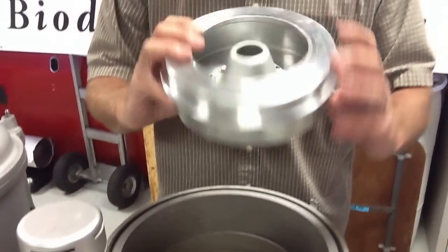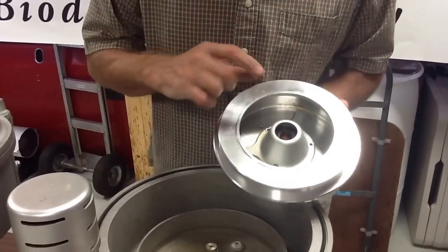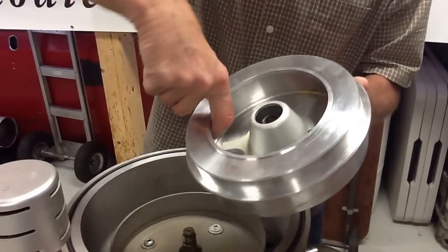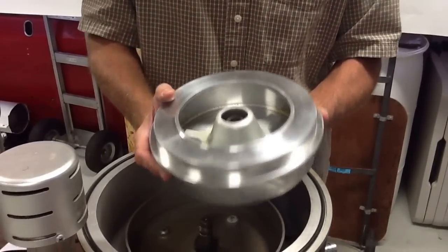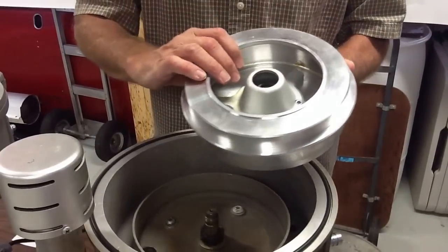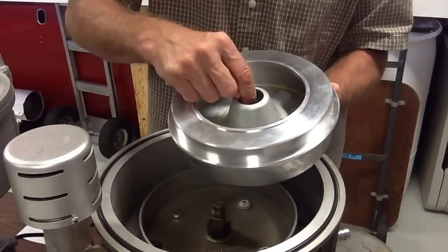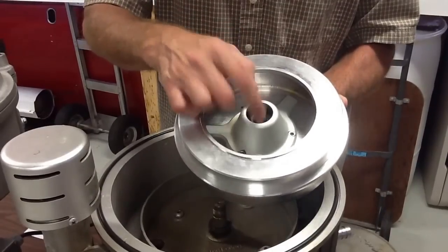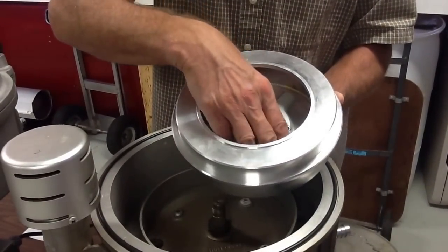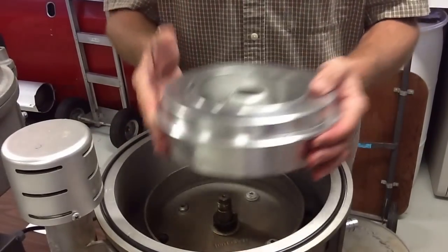WVO Designs has the smallest bowl. They don't have a removable lip or even a lid. This is tight — if you want to get in there and try to scrape, if you know anything about waste motor oil, a lot of times you're scraping. After they built the unit, they realized oil would splash, so then they, as an afterthought, built the power cone. The power cone forces the oil to the bottom of the bowl so it can work its way through the total gamut of forces.